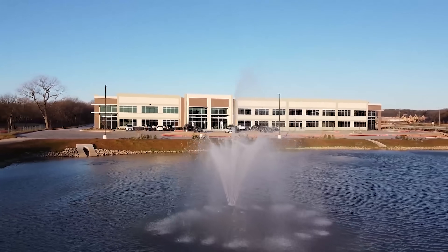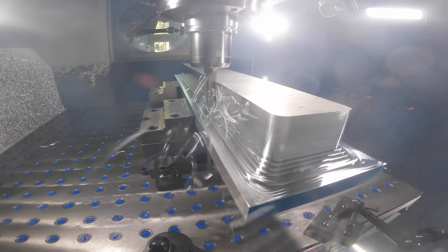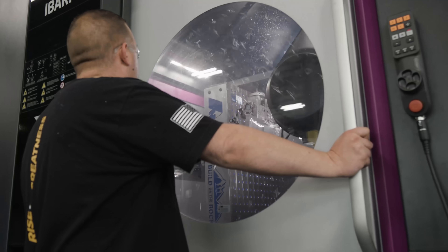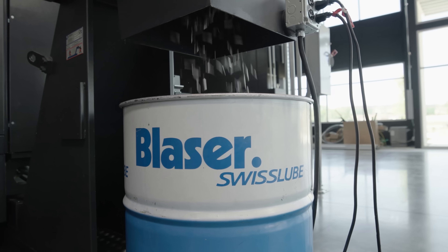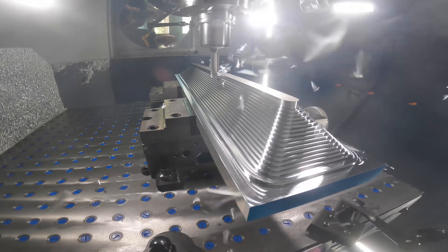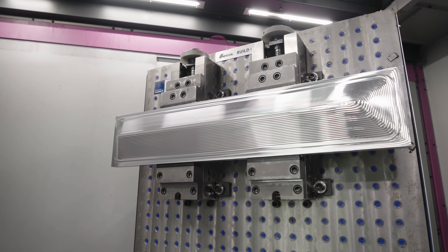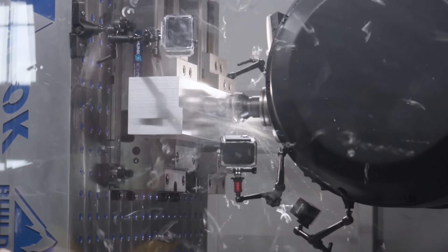In a similar situation, I agreed to spend some of my spare time to help out a local shop in New Braunfels that my brother was working at. My brother is a good machinist, and these guys had decent tools and current CAM software. But their machines were getting on in years — around 20 years old. They had quoted a bunch of 5-axis work in magnesium but only had 4-axis machines. So we had to figure out so many things to even make machining these parts possible — things like drip feeding the programs, the work holding, compensating for mechanical issues with the machines. We ended up doing some very sketchy stuff to get through those jobs. The age and condition of these machines were such that it took at least five times the amount of time and energy to get them set up and going as it should have.